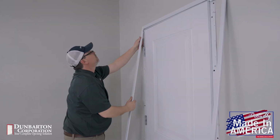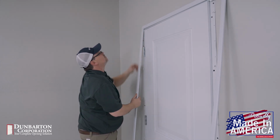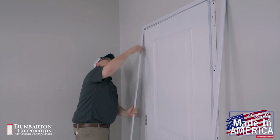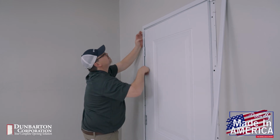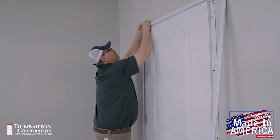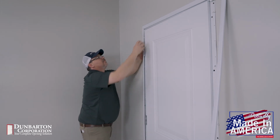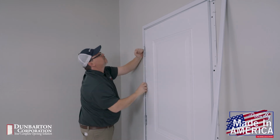Slip the upright casing onto the casing corner clips that are in the header. Ensure when snapping the casing into place, always hook the casing over the wall side of the casing frame lance. Snap the casing in towards the door to secure. Before you go any further, check to see the header casing is centered on the frame by checking for an even margin on both sides.